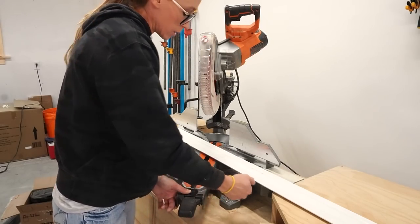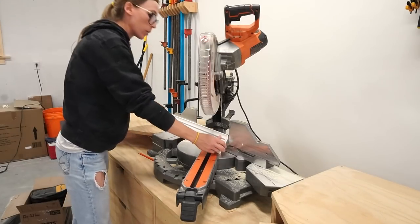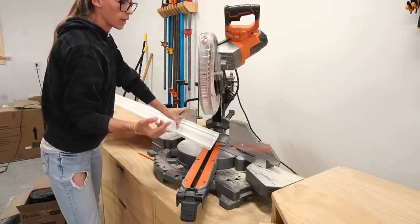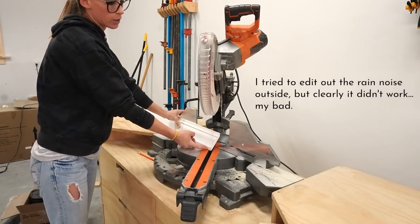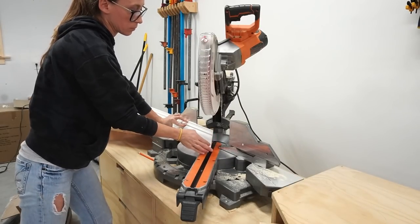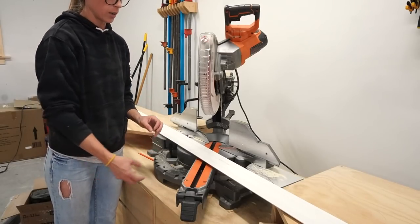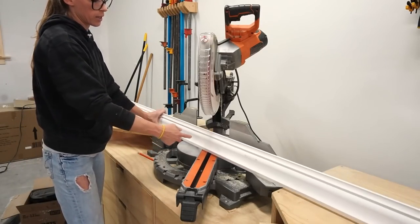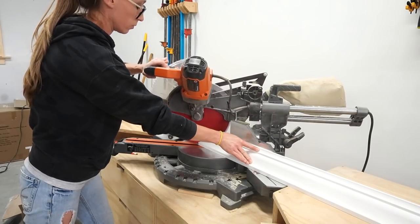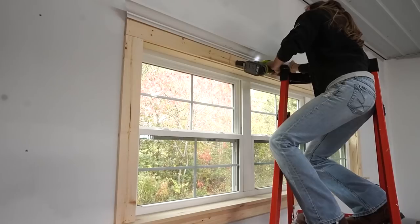I turn my miter saw to 45 degrees. On outside corners the top is longer than the bottom, so I'm going to set this up upside down here. I want to make sure it's nice and flush, square, sitting in here — flat across the back, flat across the bottom. So when I make this cut, my top is going to be longer than my bottom. Once the first end of the crown is cut, I flip it face down and measure the flat part on the back side of the bottom edge and mark the length that I cut for the top 1x4 board. For the other side, I turn this the opposite way — upside down — and make the top on that end longer than the bottom, so that'll be my front piece. It's always best to cut a little long and if it doesn't fit, you can trim it until it does.